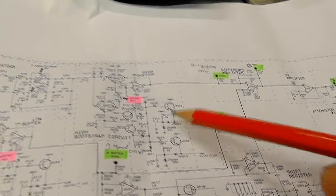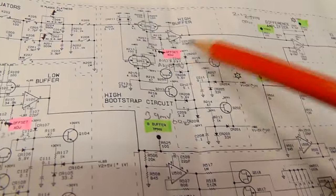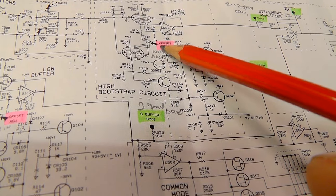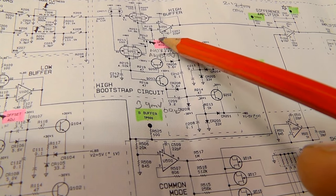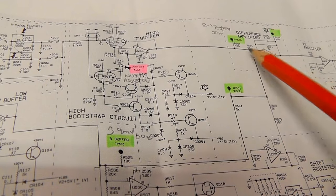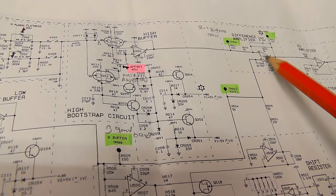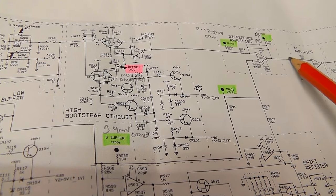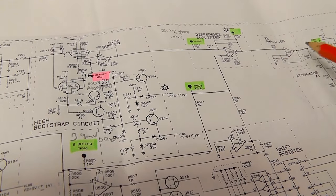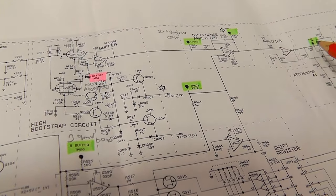Just running through the calibration — unfortunately it's not straightforward to mount these boards on extenders. I bought a ribbon cable — a floppy drive cable — but unfortunately pin one is transposed from one side to the other, so you can't use the board; it shorts the power supply out. Channel two's still got a bit of a problem occasionally where it's got a high DC offset. Looking at the scope here, channel two of the DSA has a DC offset, while channel one is correct — its DC offset is zero, as you'd expect.